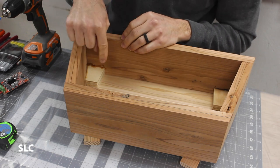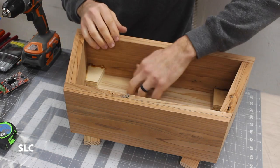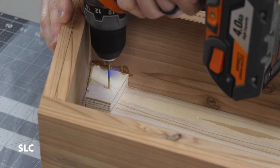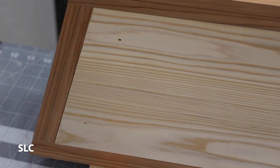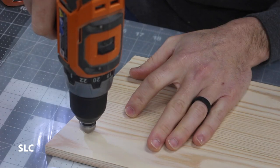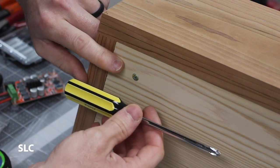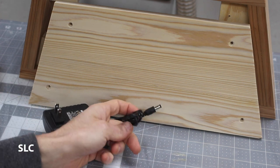In this case I'm going to be drilling from the inside out. That's not usually a good idea if you want to keep the surface smooth, but because this is going to be a back panel I'm not as concerned. Now that I have the holes drilled all the way through, I'm going to take a countersink and make a little divot so the screws can sit flush. I strongly suggest the first time you put the screw in to do it with a regular screwdriver so you can feel if there's any extra tension. And before I forget, I need to put one extra hole in the back so the plug wire can go through.